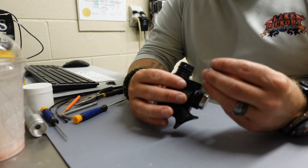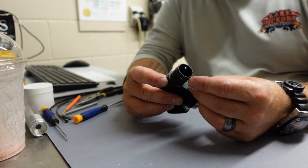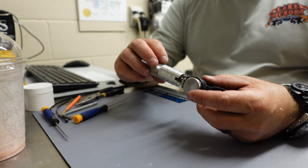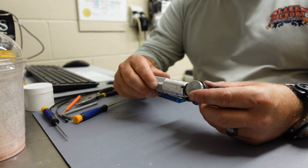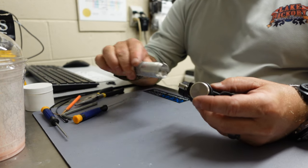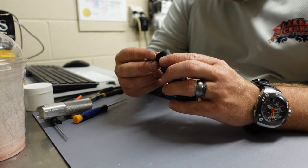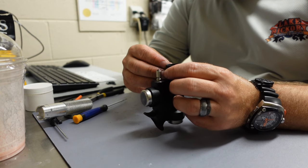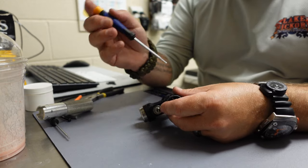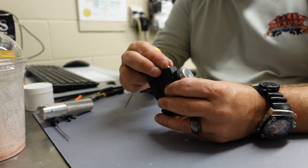I'm going to go ahead and put the last little part in. One last thing to think about: you're putting a lot of metal parts in a plastic housing, so be very careful any time you're putting metal into plastic because you can strip out the housing very easily. If you do, that pretty much ruins the entire system. So always be careful — do not ever over-tighten things, just go by the manufacturer specs and you should be fine. That's going to be it for servicing this inflator. Pretty simple procedure, something that needed to be done, and if you do it in the proper way you're not going to have any issues. The inflator is something that can and does tear up from time to time — this is why during the open water course we learn how to disconnect and reconnect the inflator hose. It's usually just a simple fix: tighten something down or replace an O-ring, and it gets you right back diving. Most of the O-rings that go in here you can keep in your save-a-dive kit, and it's an easy fix.